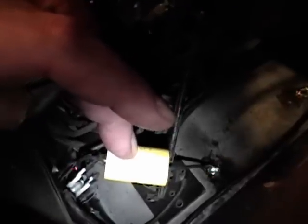It's kind of a bummer because this resistor is actually attached by two screws right to the chassis with insulated washers, and I'm never going to be able to find an exact replacement. Most of my newer components will be hidden inside this box and inside this can so it'll look authentic — except for this big white resistor hanging out, and also this yellow cap. The original capacitor was gone, but from that artist's sketch I'm pretty sure there's supposed to be a cardboard cylinder for the capacitor that screws in right here. I have another Spartan radio that uses the same capacitors, so I think I can replicate it — it's really just a cardboard tube I could slip this capacitor inside, maybe replicate the printing to make it look authentic.